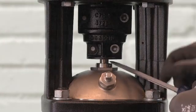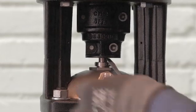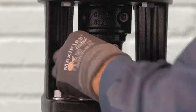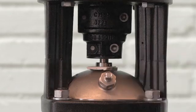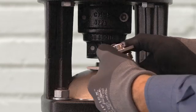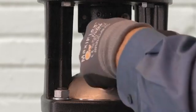Once we've loosely assembled the coupling, we'll use the screwdriver and lift up the coupling, then insert the spacer. We've now inserted the spacer in between the shaft seal collar and the hex nut on the seal. By doing that, we've put tension on that spring. Now we can tighten down our coupling the rest of the way according to the torque specifications for this pump.